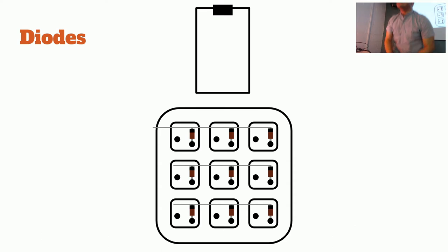Never mind. Okay, so now that you have the switch posts soldered in, take that extra leg and bend it over so that it's touching the other diode and solder that connection here, right? So we're effectively going to create a row reusing those diode legs. This may be kind of a tricky technique to get, two wires to solder together, but it's not impossible. I believe in you. If you need help, let us know. But we're going to bend those over and just create one row, right? So just like in the diagram here. So bend them over so that they are now in series, in parallel.